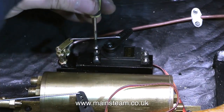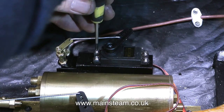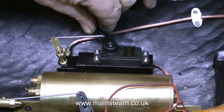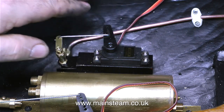It really is important to pre-drill any servo mounting holes because if you make a servo mount and don't drill a pilot hole and force a screw in there it's likely to split. And it's horrible if you hear that crack as the wood splits. As you can see in this clip the servo moves the valve okay, and it's just a case of what to do with the wire.